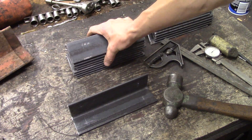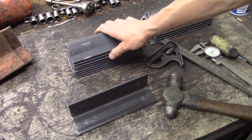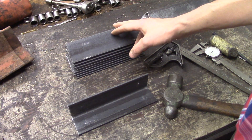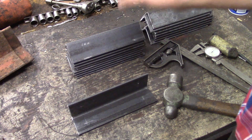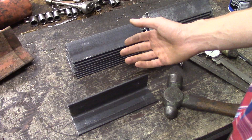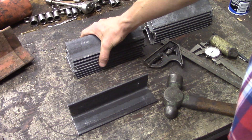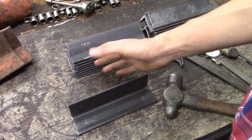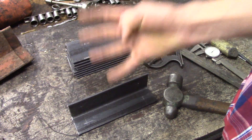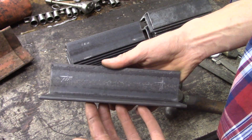Welcome back to the shop. I've got a project on the table today: making a skid for my 15 horsepower Patton Brothers oil field engine, and also making a skid for a lively steam engine we have up at the farm. Both require a lot of the same parts. In this case I believe there are 16 pieces of angle iron, and they all need 4 holes each. Here's an example of where the holes are going.